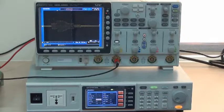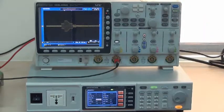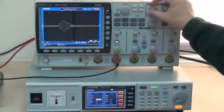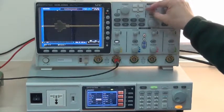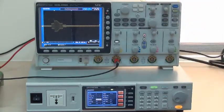How to execute twice. Change the jump count for step 5 as 1 to execute twice. First, enlarge the time base range. Move left trigger time base to the second frame of the left-hand side. Press again APS-7000 output for sequence mode execution.